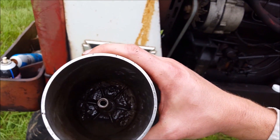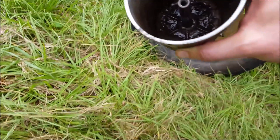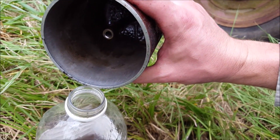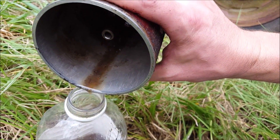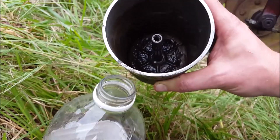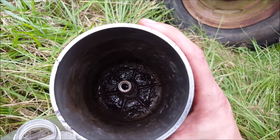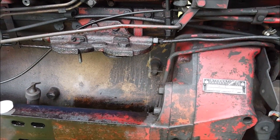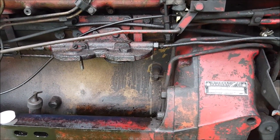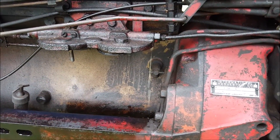That is nasty. Let's see if we can see it as it poured out. I don't know what that is — where did that come from? Must be at the bottom of the tank. The other canister had sludge in it as well. How that sludge got past the filter, I don't know. It should be dripping faster than that — we definitely have a problem in the tank.